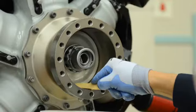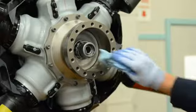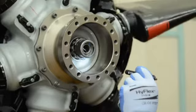Inspect the oil for metal particles. Use a clean cloth to clean up oil inside the coarse pitch chamber. While the dome is removed, this is a great time to inspect the inside of the coarse pitch chamber for damage or debris.